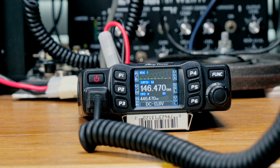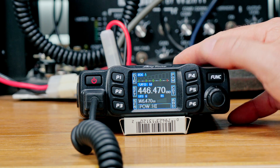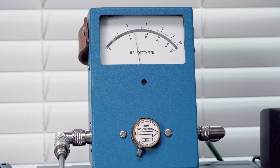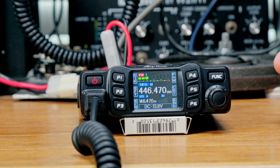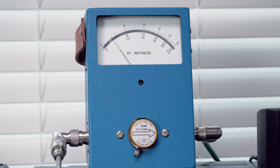Calling from Memphis, Tennessee, getting ready for Thanksgiving. Sitting on the 440 band for a quick power test: about 18 watts on high, 10 watts on middle power, and about 3.5 watts on low. On 2 meters, the levels are about the same — 3.5 low, 10 mid, 18 high. The readings are a little low compared to the spec of 25 watts, but that may be the meter.